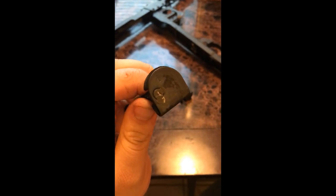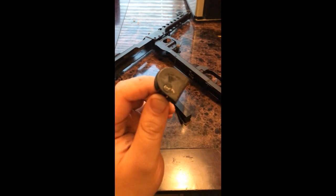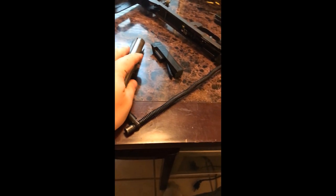To fix that, I ended up tweaking the rod. This part is fixed in place but the rod back here is not fixed in place, so I ended up tacking it and just grinding down the welds — but you could also use JB Weld or whatever you want to fix it in position so it can't rotate. All I did was bend the rod slightly inward and upward, and that keeps it pushed into the groove of the bolt face. It catches the casing a whole lot more reliably than it does from the factory. Before that it would just fail to eject, or the casing would ride all the way back with the bolt and get lodged in the bottom of the action.